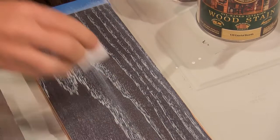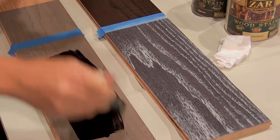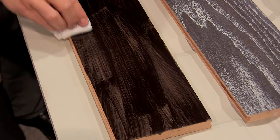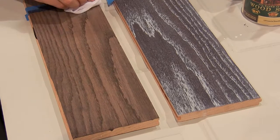So that's the darker board. What color would you put on this gray one? I'm going to choose a black color stain. It's the same process — just get it on the surface and wipe off the excess. It occurs to me, this is a fresh application of stain, poly, and now this glaze. I've got some flooring at home that used to have a two-tone color, but now it's just one tone. A lot of pre-finished flooring comes with a two-tone. Eventually that gets worn out and you want to refinish it. To get that same look, you're going to want to use this exact technique. Once this glaze coat is dry, you're going to want to protect it by applying one or two more coats of Zar polyurethane — just like any other floor at that point.